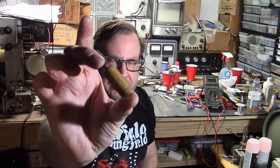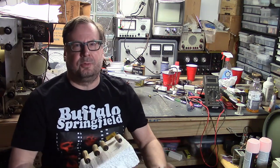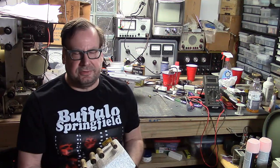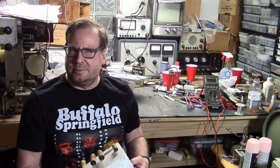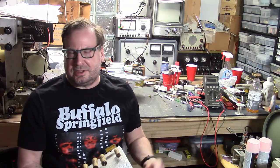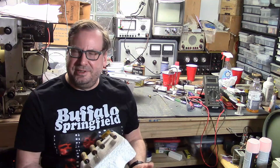In this video I'm going to present a tutorial on restuffing vintage paper capacitors — the type that are a roll of paper and metal film inserted into a cardboard tube and then sealed with wax. That's a somewhat controversial topic — is it worth the effort, who's ever going to see it, why bother? Well, it definitely seems to be more popular in the radio community than the TV community, and I can understand why — there are fewer capacitors in a radio than a TV. Technology was constantly evolving in the 20s and 30s so there are a lot of different capacitor types, some of them interesting-looking. Caps in Bakelite, metal, or cardboard present a challenge to hide the new parts inside the old parts so it looks like no one was ever in there — that's the appeal to some hobbyists.